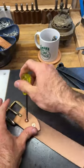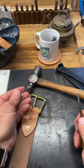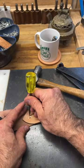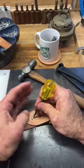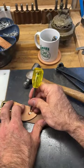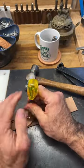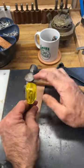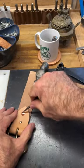And that should do it — just like that. If you want to be a little more dynamic, you can usually get that done in maybe two hits if they're bigger ones, but that can be a little more destructive to the leather underneath. This is about the most reliably non-destructive way that you can remove these. It'll work on copper, it'll work on brass, and to a limited degree on steel. It works really well on aluminum and on smaller size stuff.